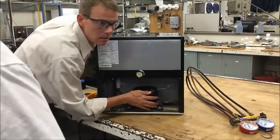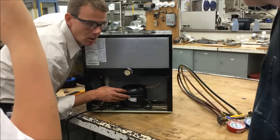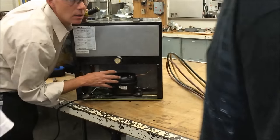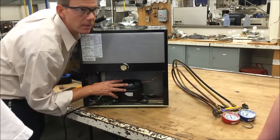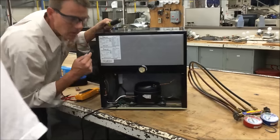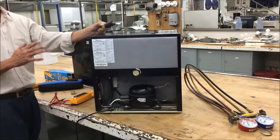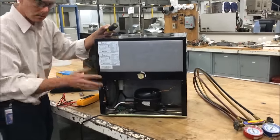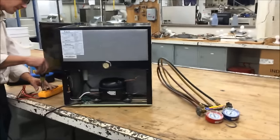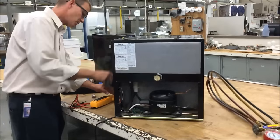You hear that click? It's humming — it's not vibrating anymore. Now it's humming. So now we've got to put the amp probe around it to measure the current flowing through the wire. If I can't clip around one of these wires, we'll have to unplug the power and take that black case off. That black case will reveal our overload, which is what you're hearing click — just like that one I just heated. There's another part they use in heating called a sequencer — it uses the same thing, heat and temperature, to activate the switch.